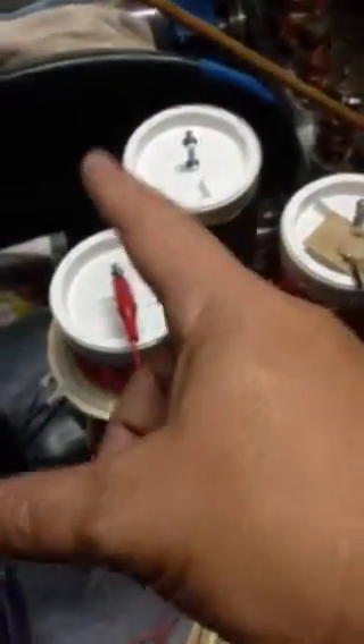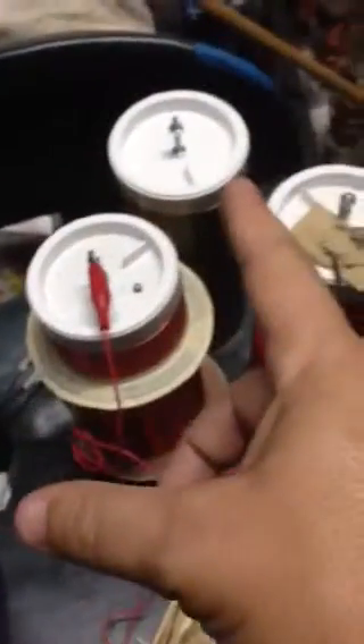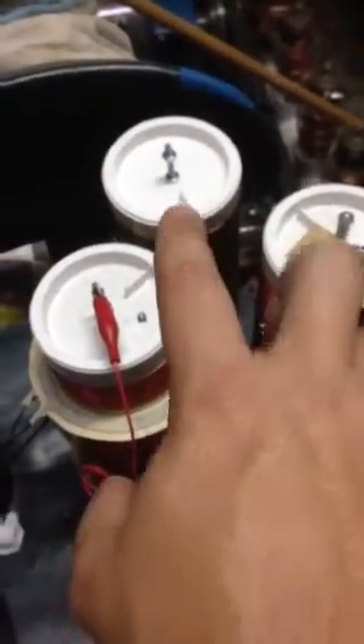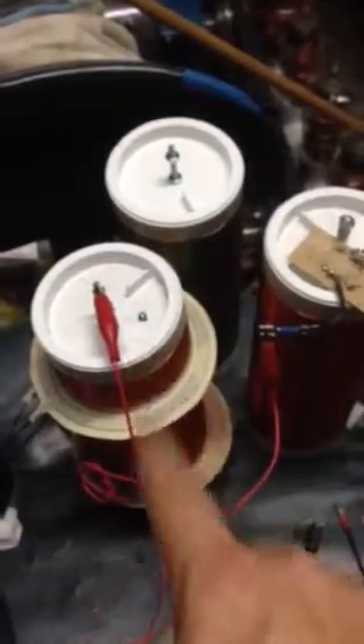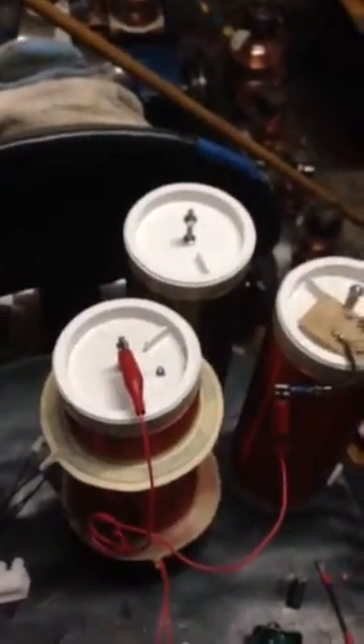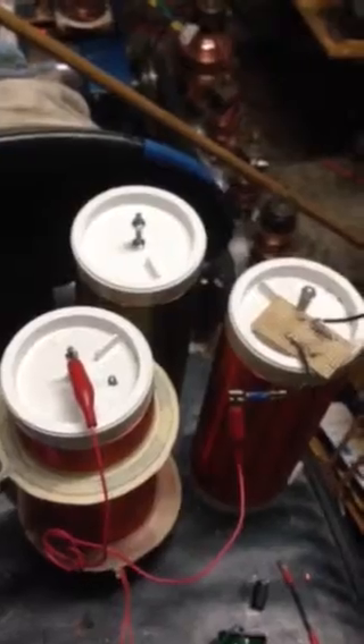I've actually ended up moving this coil, which was over here more, over to the right to be more of a sheer influence on the positive and negative. So this is positive, this is negative, and this is the base coil. And these are the two five-wire pancake coils put in series now — curiously, when I first put them in series, there wasn't any real noted difference in the waveform. So it didn't double like I would expect with an increase in turns while having the current halving.